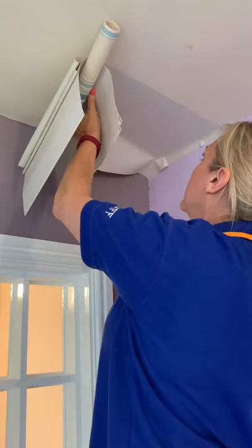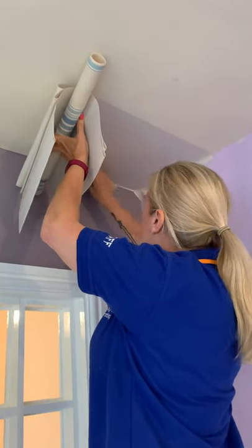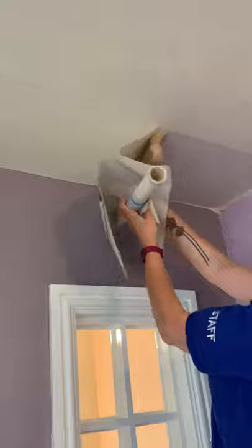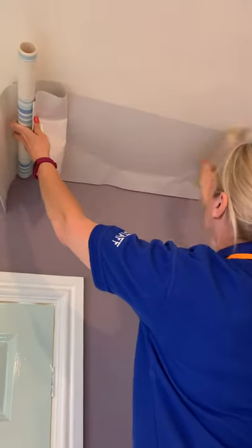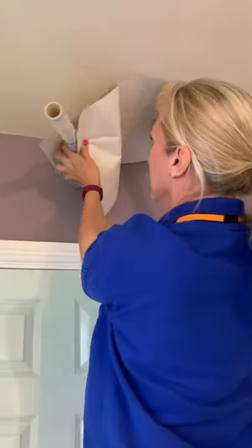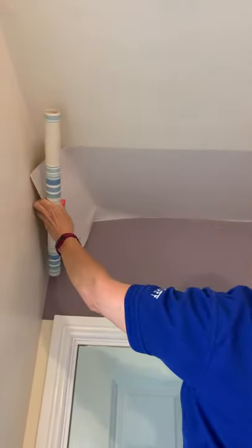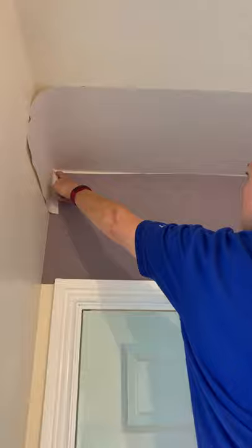Moving brush — on the line. It's quite lightweight so it wants to fall off, but taking it like that, holding the rest up with your crutch, bringing it across the line. Always watch your step as well. Taking the last fold, keeping it on the line. So you've got a few things to think about: keeping it on the line, keeping the crutch in the air, and folding that last bit. You can see where the wall runs out — that's the reason for a snap line. That is dead straight. Another reason you'd need this is because if you tried to hang towards the wall it'll twist your paper, and if you're putting patterned paper on the ceiling you're going to lose the pattern — it's not going to match up.